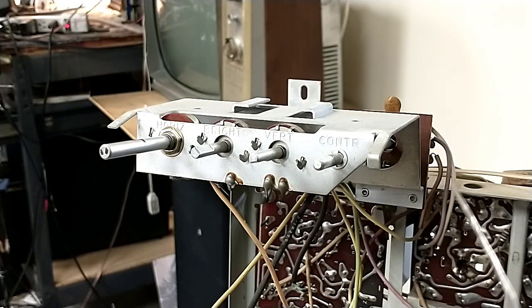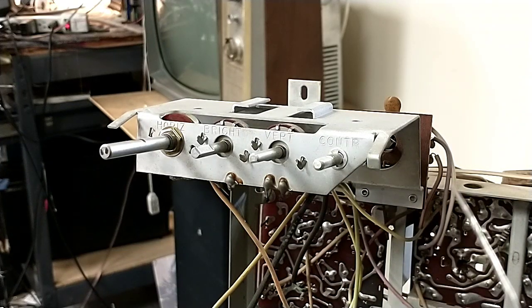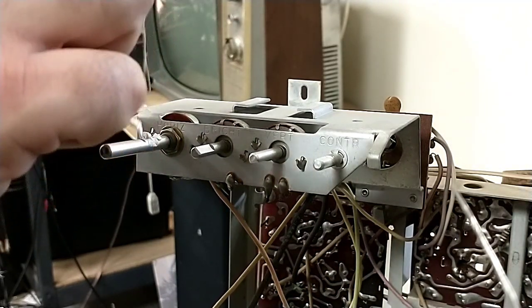probably get the vice grips and some thermal compound to act as a heat sink so that it doesn't kill the damn pot. And y'all may think I'm crazy for doing this, but I found that if I alleviate a lot of the heat that's created during the process, it's less likely to murder the part that I've just installed.